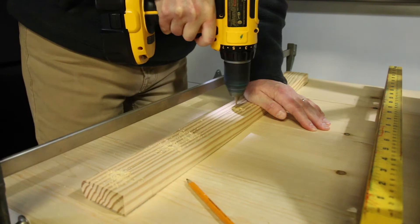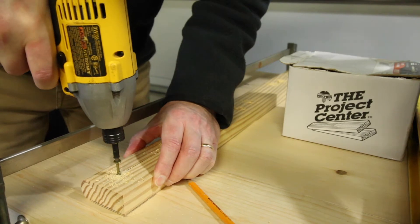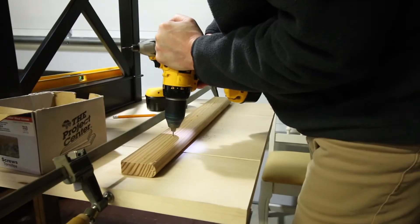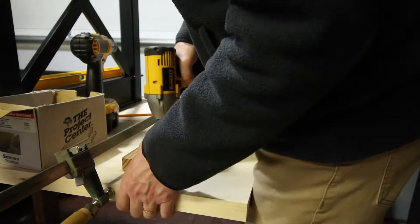Once we got those four cross pieces laid out and figured out where we needed them, we drew a line down the center of each cross piece so we knew exactly where to screw in the nails. Next it was time to drill the holes from the cross piece into the actual tabletop, which was really scary — we didn't want to drill through the board because then there'd be a hole in the top of the table, and we didn't want to move the cross piece between drilling and screwing it in. We went with two screws in each board to prevent any bowing. This took the longest — there were four cross pieces with about eight screws in each, and it was probably the hardest part of the whole DIY.